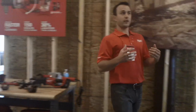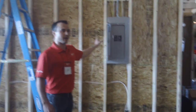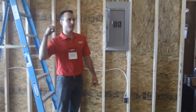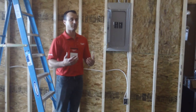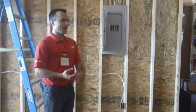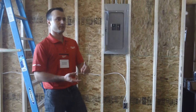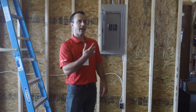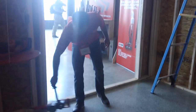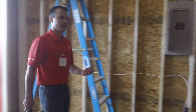First, what I want to do is walk you guys kind of through the day in the life of an electrician. So if we can kind of just spin around and shift around real quick. First thing an electrician does when they get to the job is they locate where their panel's going to go. They locate their outlets, their light switches, and if you think about the wire they have to run. They have to run a wire throughout the house for each bedroom, for each bathroom, for all your appliances, your dishwasher, your water heater, and they're drilling every 16 inches, right? So they're drilling 300, 400, 500 holes in a single home.